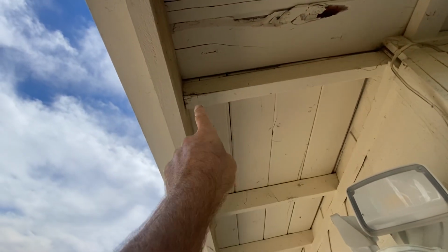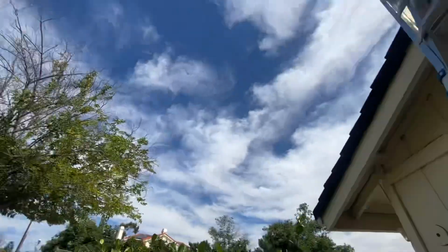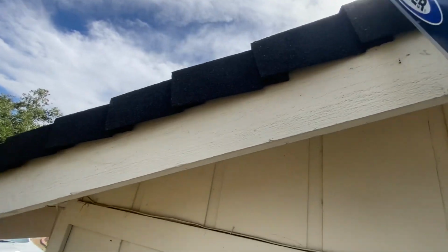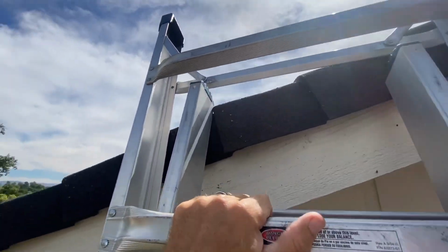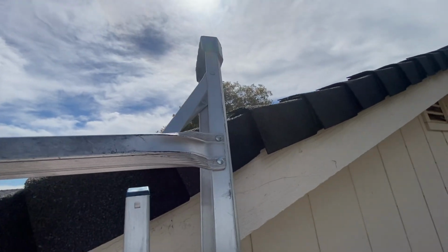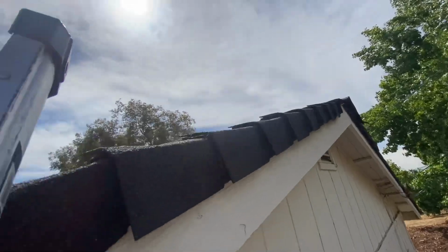And then these are called rafter tails that are going out from the rafters of the home out to the edges underneath the eaves. And as you get over here, we've got the fascia board that's right here. And so we've got some rotten fascia board on part of the house as well, just due to the roof's age. Homeowner told me there was an overlay done, so we've got original underlayment and just kind of doubled up